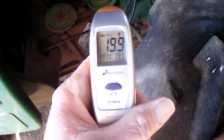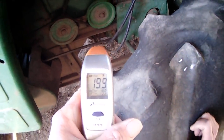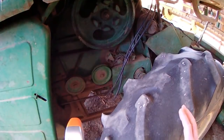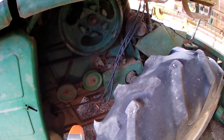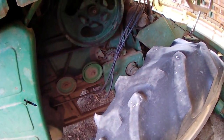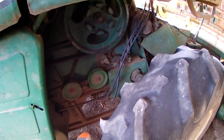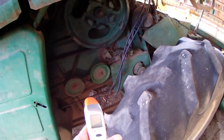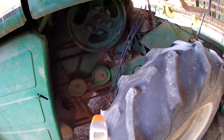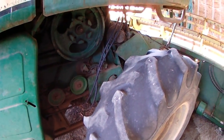We're back down to cold weather again, so you can see that's reading 19.9 degrees Fahrenheit. What I did to establish a history and know what these temperatures should be — I would shoot them about 15 minutes after running, then I'd go out running with this tool and shoot all the bearings to see if I had one that was hot. If I had one running above the established normal temperature, I knew I needed to get a replacement on that one, or I was going to have a big, costly, expensive problem.